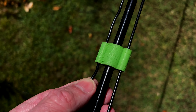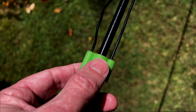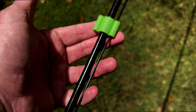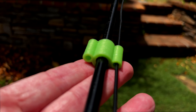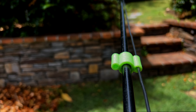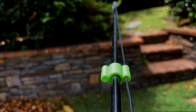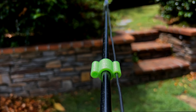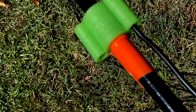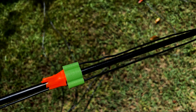Well, I got the 3D printer out and printed off this little three-hole device. What I did is put it down the pole and then it gave a nice clean separation of those elements up and back down. It actually was a little bit too big on the center pole, so I just used a bit of amalgamating tape to actually bring it back up to where that 40 and 15 meter element comes to.